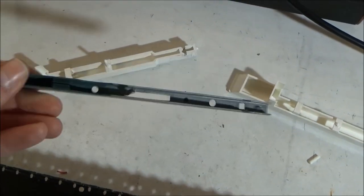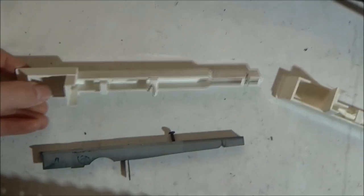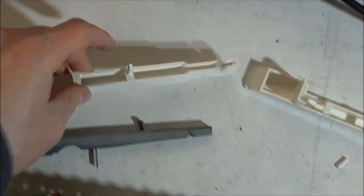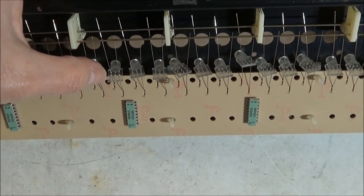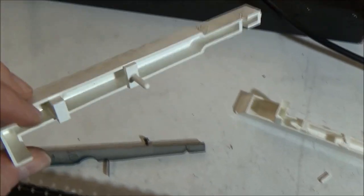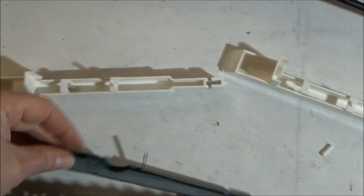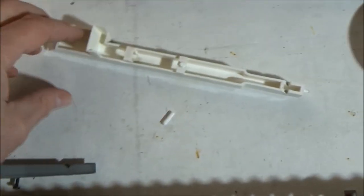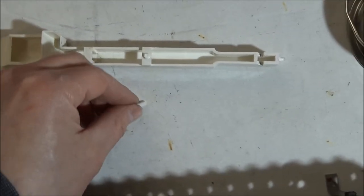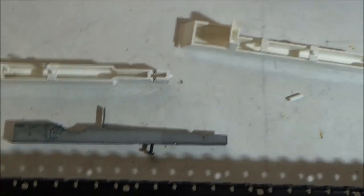Also, they show you that broken key. So this is what one of these style keys looks like. This is the little shaft that connects to the little plastic thingy down here that guides the wires into the bus bar. Nice technical terms, thingies and stuff like that. But anyway, on the older style that you may be more familiar with, that's metal. This whole thing is plastic, so this is fragile and often breaks. So here's the one that broke. I'm going to try to reattach the little piece that broke off, and if not, we can always just replace it